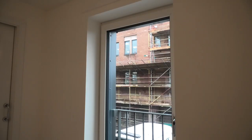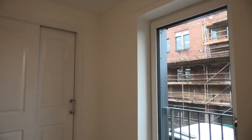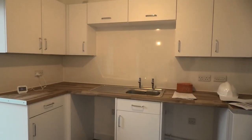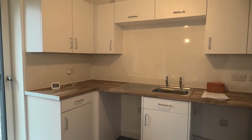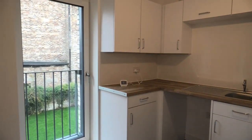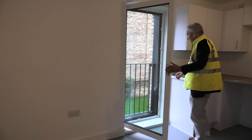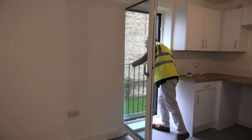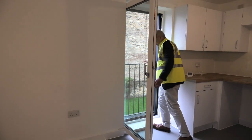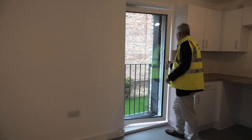Instead of just insulating the walls and the loft, the insulating layer is around the whole of the homes. Super insulation and very good levels of air tightness create a tea cosy effect which keeps the heat in. Passivhaus homes optimise the heat from the sun and therefore need very little extra heating, and they use photovoltaic panels on the roof to capture daylight and turn that into electricity.